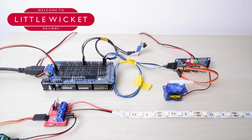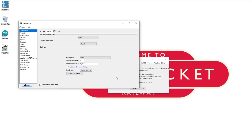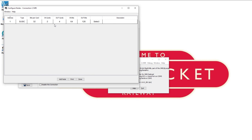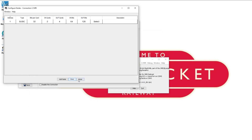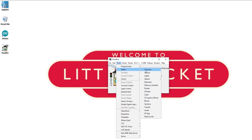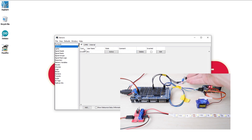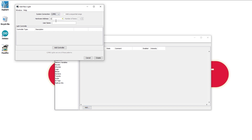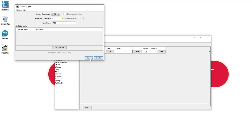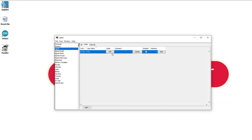We've got the LEDs attached to the MOSFET module connected to pin 46 on the Arduino — let's get that set up in JMRI. First thing to check is you've got your CMRI connection on node 1 with baud rate 19200, and we've updated the card so we've got two input cards and four output cards. Open up your tables — we've already got the turnout and sensor from video one. Now let's go to the lighting table, go to the CMRI tab and select Add. In the hardware address we need to use 1101 because that's the address we gave to pin 46 in the sketch. Give it a user name like LT1 and click Create. Now if you click on the state we should hopefully see the MOSFET module activate and the LEDs come on. Another cool thing you can do with this lighting table is add a controller.